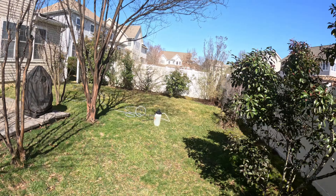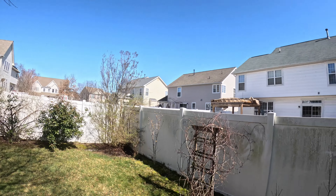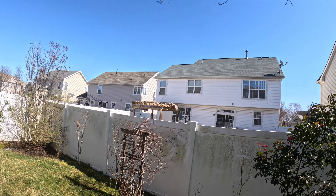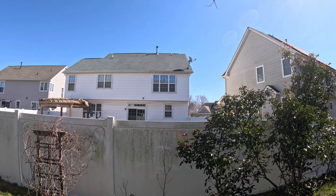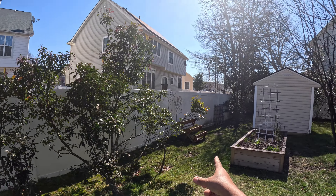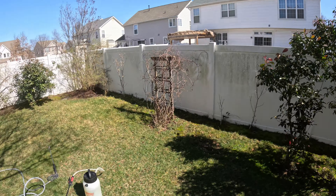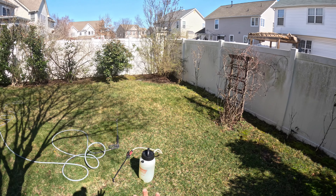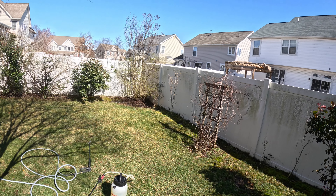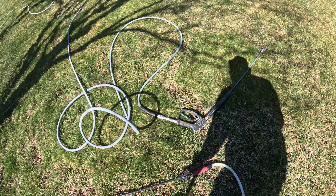In the 50/50 mix, even though that's six percent, by the time I'm downstreaming and it hits the wall, it's been diluted down to like 1.2%. That's not strong enough for that. I need like a three and a half percent or up. So in that jug right there I have a four percent solution. Soft wash is just SH and water, no surfactant.